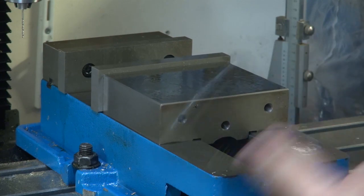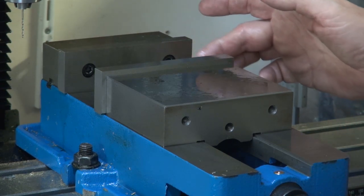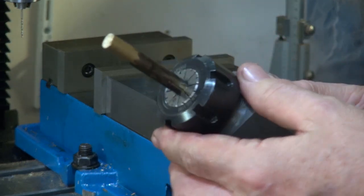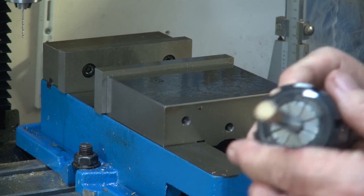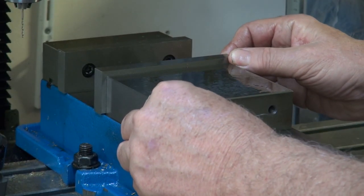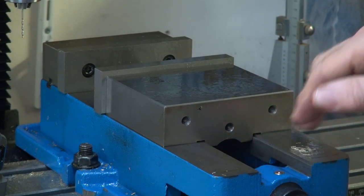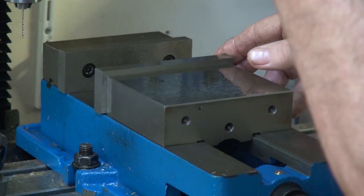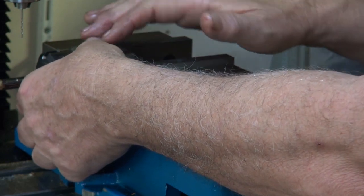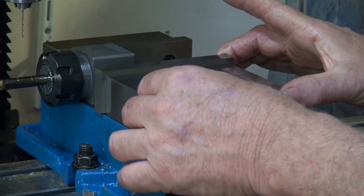What I'll do is we'll do an operation on it. What I want to do is machine up some aluminium or brass blocks to put in here, so when I'm using these free ER32 collets — by free I mean they're not on a spindle — I don't get any racking. There is a very, very slight amount of racking, which is basically play in the screw thread, but nothing to worry about. I'll make up some blocks the same size so when I put one in here, I can put the same size block on this side, and that will take any of that racking right out.